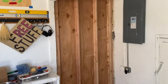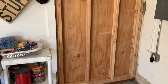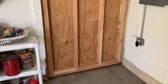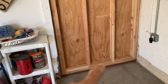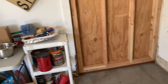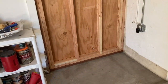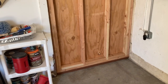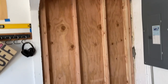Here's where a door used to be. This used to be a carport, and then the previous owner put in the walls, and that's why there's no concrete stem wall at the bottom. They just put the two-bys right along the old concrete pad, and I'm just trying to match that. There was a door here and I've taken it out, reframed it, and put the sheeting on.